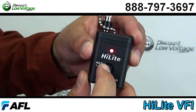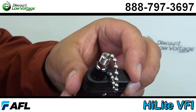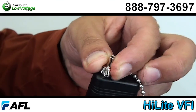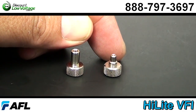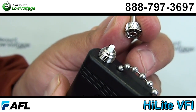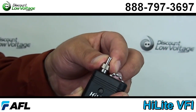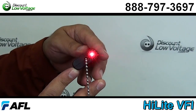The Highlight offers quick connection and tests the single ferrule connectors such as FC, SC, ST, LC, MU and more. Keep in mind that the size that comes with the Highlight is a 2.5 — it's for that size ferrule. Now if you're going to do LCs, make sure to purchase the adapter piece that you screw on, making it a 1.25, so that it makes a proper fit and works best for you.